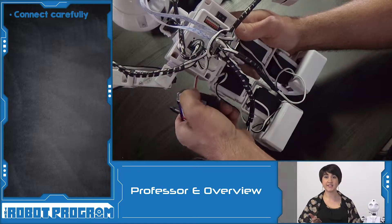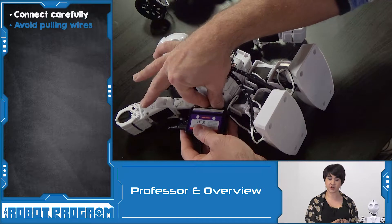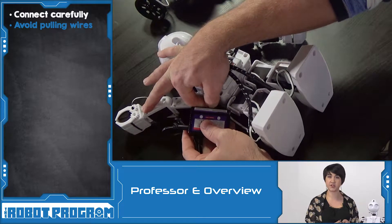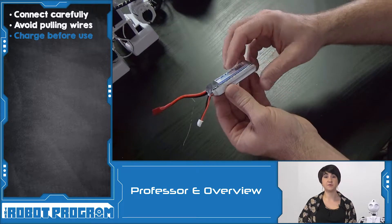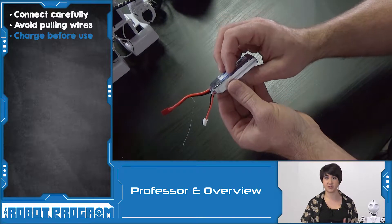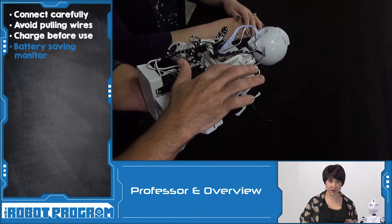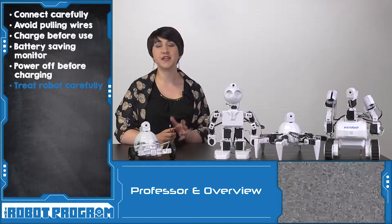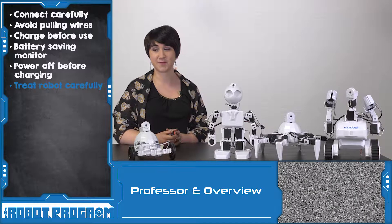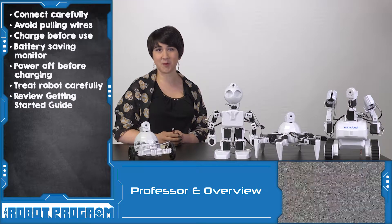In this episode, we reviewed the charging and care of your robot battery. A couple of important things to remember: when connecting and disconnecting from the charger, don't tug on the cables — use your thumb and finger, especially your nails, on the actual connector, not the wires. The first time you charge, let your battery charge the full cycle due to its chemical memory. Pay attention to your battery monitor — if your robot says it needs to be charged, turn it off and then plug it in. Never charge your robot while it's still turned on. Don't get your robot wet — treat it like an iPad or other electronics. For additional information, you can read the Getting Started Guide.